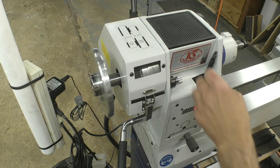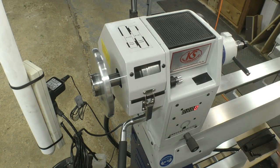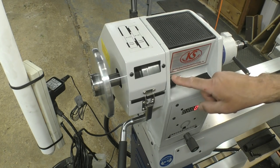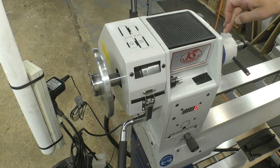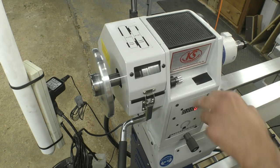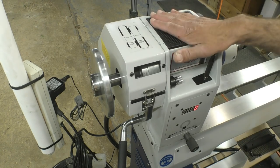This little chappy here locks the spindle — that's for changing your chuck and so on. You can see that little protrusion there. On the older models there was a similar configuration where it was a spring which mounted in there for the spindle lock, but apparently they were experiencing quite a lot of problems with the end breaking off, so they went to the more common solution of the bar in the hole. I've just put a bit of tape there to stop it marking the paintwork.